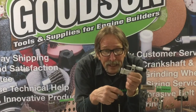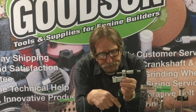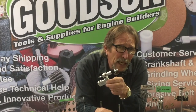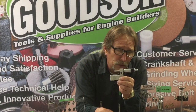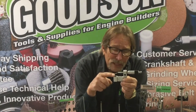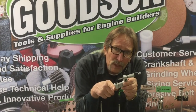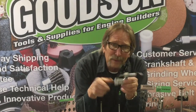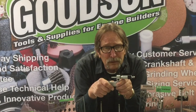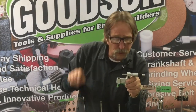This tool is only right at four hundred dollars. There are other tool setting devices out there and they're all north of a thousand dollars. This one goes 800 thousandths to three inches, and it'll work with your 375, 385, 437, 389, and 390 top pilots — all those different top size pilots we've been dealing with for a long time.